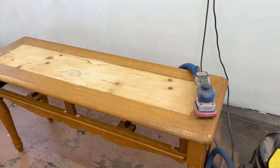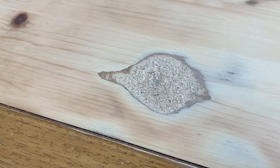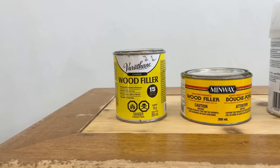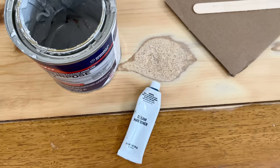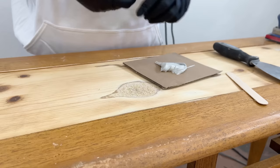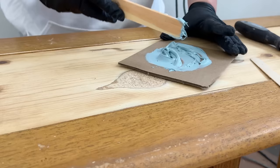This is what I was left with once things felt smooth, so now I need to fill in this gritty, porous spot and seal it up so it doesn't keep pulling in moisture. I like to do repairs like this with a two-part epoxy-style filler — these three products are all really the same stuff by different brands, so any of them will work. They come with a base putty and a separate tube of hardener that must be mixed together to create a chemical reaction that cures it. These fillers stiffen up really quickly after mixing, so it's helpful to mix multiple smaller batches instead of one big amount. They're also very stinky, so make sure you're wearing a respirator and working in a well-ventilated area.